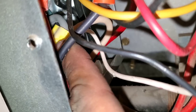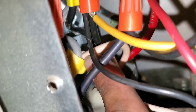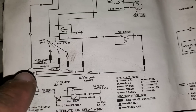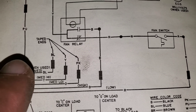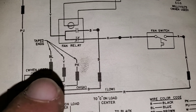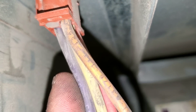The white wire comes back up from my harness and ties in with the rest of my neutrals for my 120 volts coming in — it's a neutral, a common. The next one we're looking at is our blue wire — BL is blue. It says 'when used,' but I do not have a blue wire coming off of my harness. I only have purple, black, yellow, red, and orange. So at this point I know the blue terminal is not used.